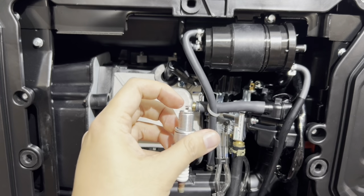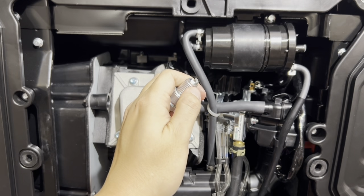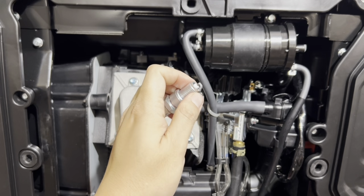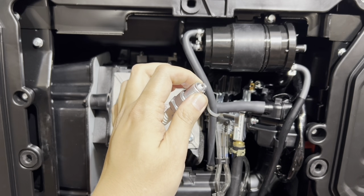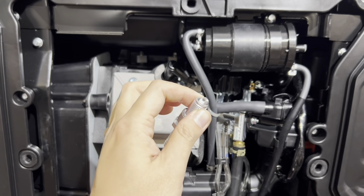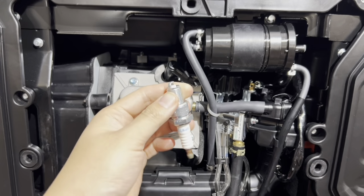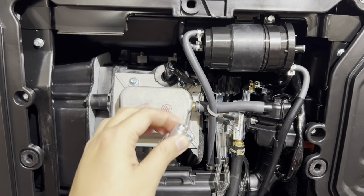What happens is that you'll introduce a hairline fracture or crack in the welded tip. This will weaken the metal in here, and on some rare occasions, this tip will fall off into the engine. You do not want to constantly close the gap, open it back up, close the gap. If you do it more than 3 times, throw away the plug. It is a lot cheaper to throw away a plug than it is to throw away a generator.